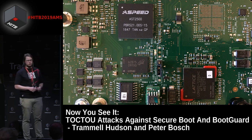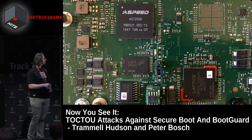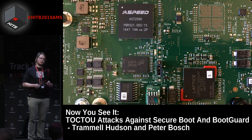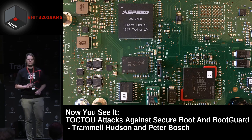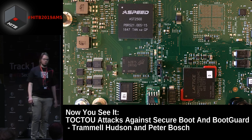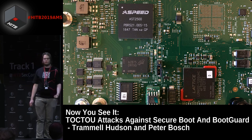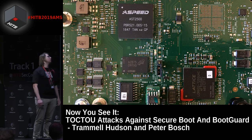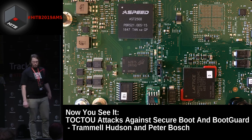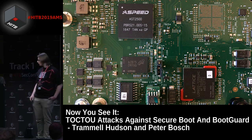It's also possible for a lot of different systems. And you can maybe see on here that there's this ROM chip sitting on some kind of a breakout board. This is actually a stock part of the hardware. We were also able to come up with a design containing the FPGA and the ROM chip that's small enough to fit in this form factor to just be soldered in place of a normal SOIC chip. So all of a sudden it's not just something you can clip onto a motherboard, but that you could actually put in there during production and have a system that looks normal, that when you run flash ROM it will seem fine, give the right results, but actually contains malicious code. So it's also something that could potentially be used as part of a supply chain attack,